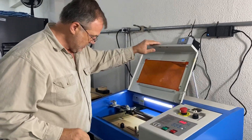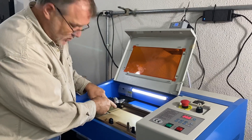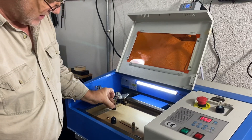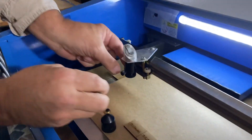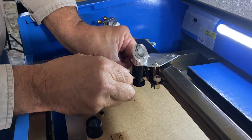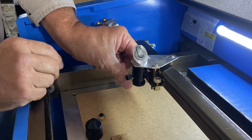The next thing is — since I make the lenses — I put my adapter on here with an adjustable focus lens, so you can put your lens in and if you have thicker work you can put it up higher, and if you have thinner work you can put it down lower. It has adjustment and you move the focal point up and down with it.